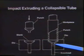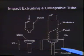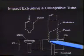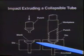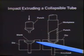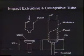If we had it threaded at the bottom it's going to be screwed in there, but if we blew an air blast on one side it would unscrew and be blown aside. At the same time we bring up another little aluminum blank, the punch comes down, and with a reciprocating toggle press each stroke produces a collapsible tube. They're very cheap commodities that we can make. I want to tell you what I think is a fascinating story about this.